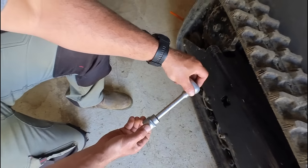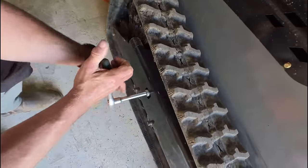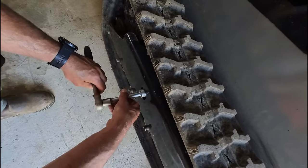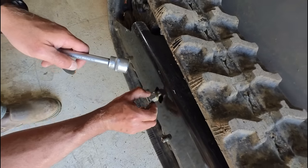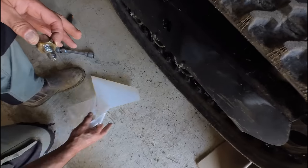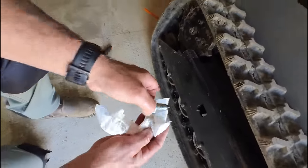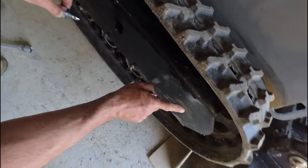So this is a 27mm socket. I've brought one up here just purely for this machine now, instead of bringing all my tools up. This does have movement here, up and down, so if you get it in the centre you just don't lose it when you try and put it back in. This is where it gets a bit messy — rags and paper towel. So this is just like a big grease nipple — you can see there's a grease nipple here where you fill it, and it basically comes through straight in and pushes this piston, which is on this wheel here. So the piston is on the front wheel.